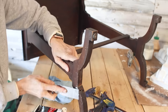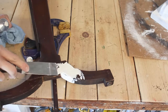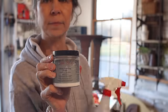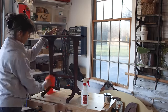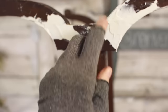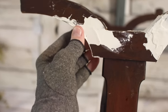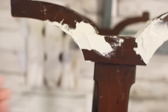The glue dried on the areas where I had to clamp and glue on the little tables, and it was time to fill the holes. I made a huge mistake — stay tuned to see what I did wrong. While I waited for the Bondo to dry, I cleaned the other table with TSP Cleaner by Dixie Belle and wiped it down with a microfiber cloth. Here's my huge mistake: I forgot to mix the hardener in with the Bondo. I had the two-step process mix, so it did not harden completely and I had to start from scratch.